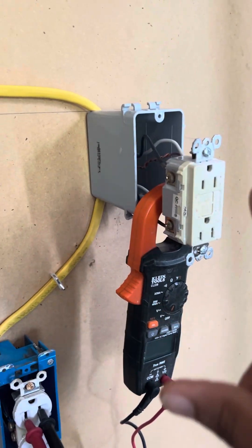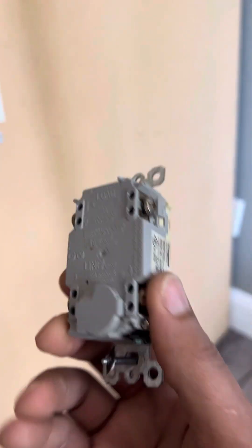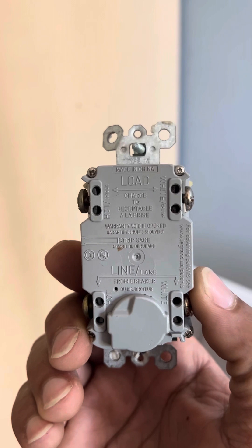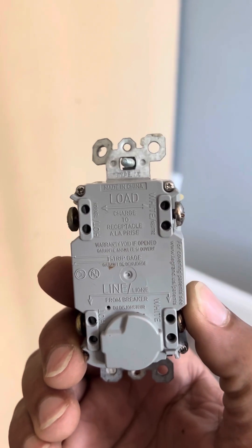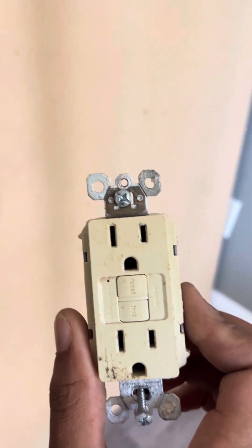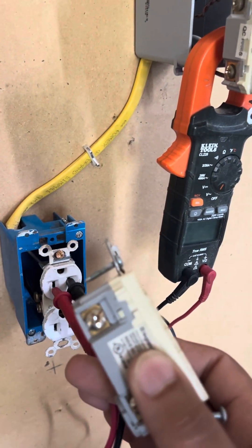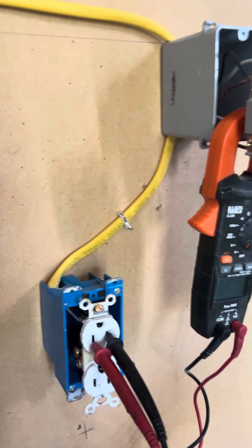You've got your line side and your load side. If you look at the back of one of these GFCIs — I got it from another job where I replaced the GFCI, they still work — you've got the line side and the load side. The power coming in goes on the line side, so it says hot here and white here. The load is going to be whatever additional piece of equipment you have wired from that GFCI. I've got a regular receptacle and this GFCI is adding GFCI protection to that receptacle on the load side.